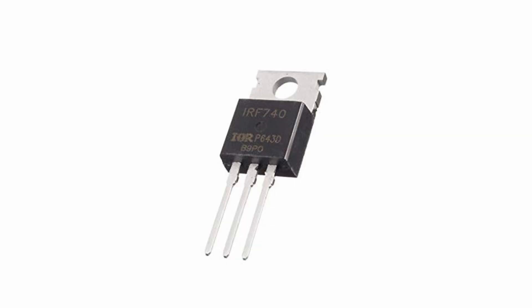all we have to do is purchase a MOSFET transistor to use as a driver. I had an IRF740 on hand, but you can also use an IRLZ44 — that could work fine — or many others. I'll leave some links in the description. It's best to use the N-channel, because P-channel have a different schematic. This type of transistor can be used as a switch, and the nice thing is that you can drive a 12V or higher current with a logic signal from the microcontroller, which is typically around 3V.